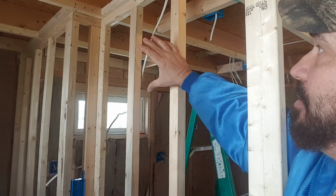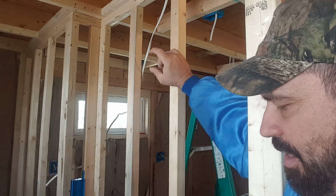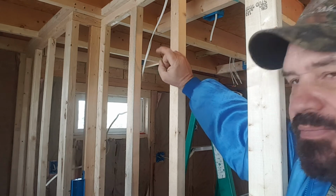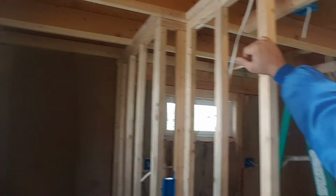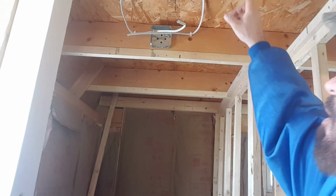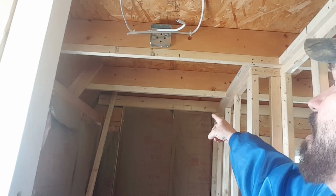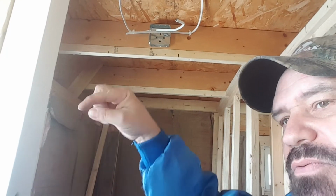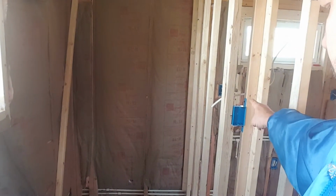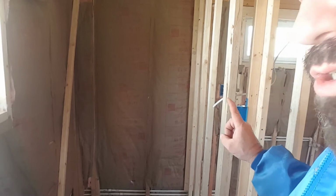And you know, one thing I may want to check is when my upper cabinet door opens. I don't know. Anyways, I'll do that. And then I went ahead and put a junction box up in here. So we got to get a board going across here for our light to hang on, and a board going across in the back over there for the light to go on. And then run wire for our plug that's right down over here, and our plug that's going to go right here. No, that's a switch. That wire, and a plug that's going to go down here. I may still need one shallow box, I don't know.